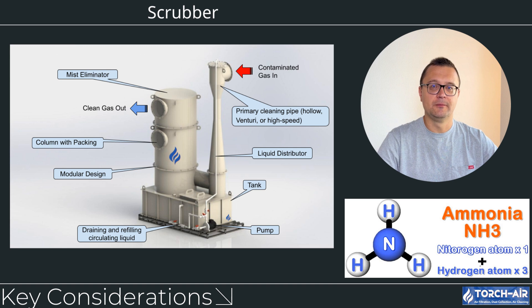Key Considerations for Choosing an Ammonia Scrubber. Ammonia concentration: higher concentrations of ammonia may require a more efficient scrubbing system, like a packed bed or venturi scrubber. Scrubbing liquid: depending on your industry, you'll need to choose the appropriate acid — sulfuric acid is commonly used, but phosphoric acid may be preferable if you want to create ammonium phosphate, which is often used in fertilizers. Maintenance requirements: simpler systems like spray towers are easier to maintain but may not offer the same performance as more complex systems. Corrosion resistance: since you're dealing with both ammonia and acidic solutions, your scrubber's materials need to be corrosion resistant — stainless steel, FRP, and specialized coatings are common choices.